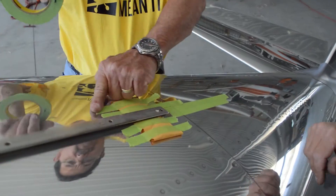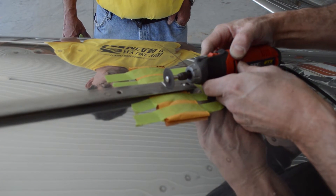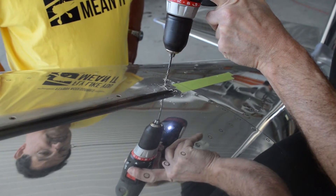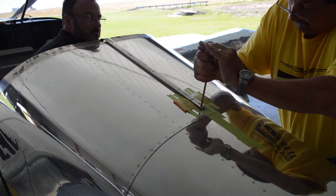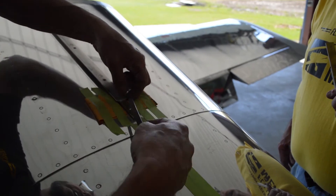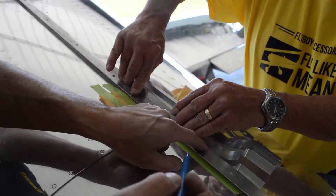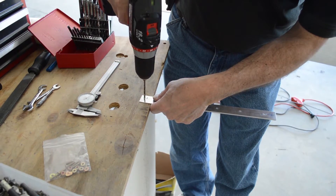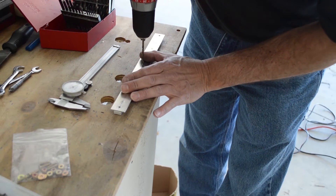Put down a few guards to keep you from scratching the plane, and cut off the appropriate amount from the top piece of the track. Do not cut the bottom piece of the track. You will likely have to drill out the aftmost rivet in the spine track to get this piece to come off. Dress the cut edges, make sure there are no rivets in the way, and align the track extension with the original track. Mark the edges for proper alignment and pre-drill the holes in the track. There will be one hole that you'll want to match drill to the original track screw, so wait to drill that until later.